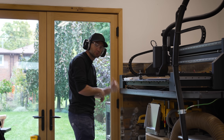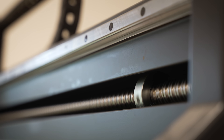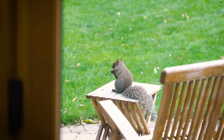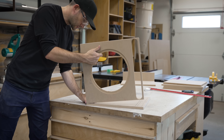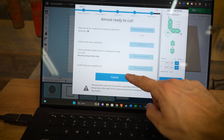Here's the thing about the port — you can kind of think of it like a secondary driver. So because I plan to put the subwoofer against the wall and have it facing towards me, the front was the obvious choice. But depending on your own setup, you could also put it on the back, the side, or even the top. And now that we're done cutting, here's what the front face of our subwoofer will look like. We're going to add some more elements too.